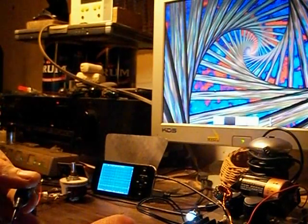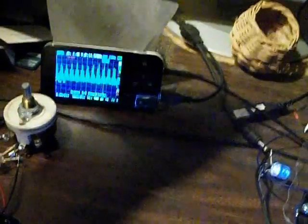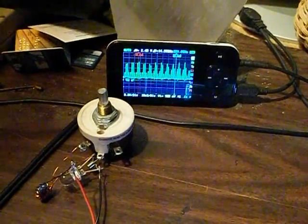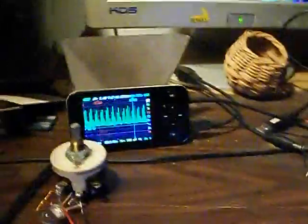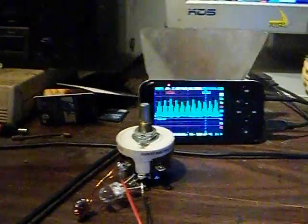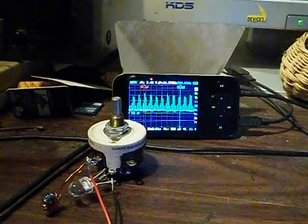We're going to go across the coil side of the LED with the probe, and across the negative onto ground. Okay, and you can see our scope trace here. Now this is a much different scope trace than we were looking at with the device we just used. Try to get as good a view as I can for you here, without the camera falling over.